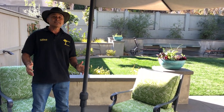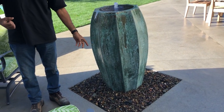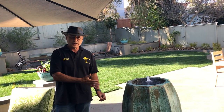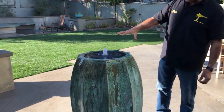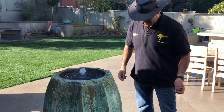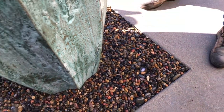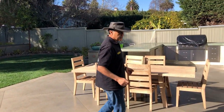So let's start here. This is a big area. When the concrete got laid, we made sure there was a perimeter that was just soil. Before it got poured, we ran pipe for an auto-fill and also for electricity so the pump could get plugged in. We also have low voltage lights — we ran 12-2 wire here and connected it to the transformer around the house. This gorgeous water fountain is actually a vase the homeowners picked out. It has an Aqua pump on the bottom pushing water up, with small FX Luminaire lights on the bottom. These are Mexican pebbles — smooth and beautiful.